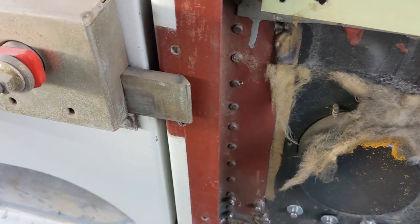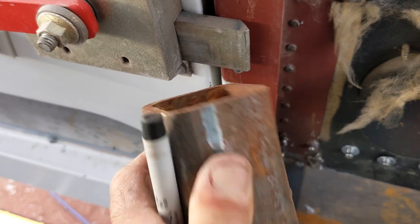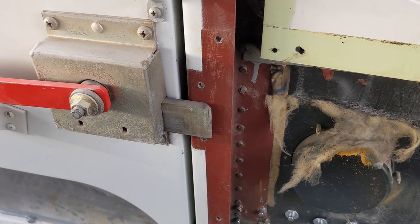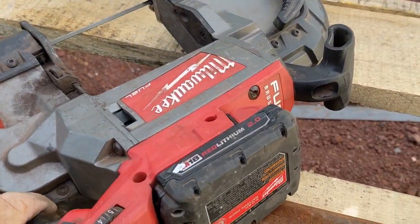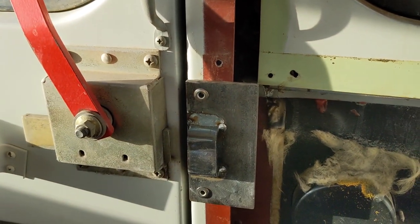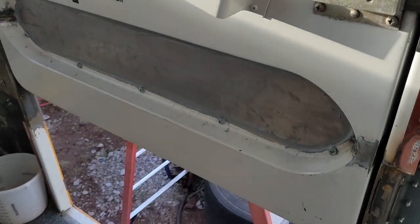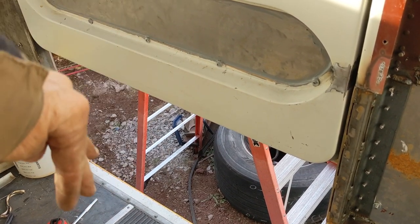For the latch I'm going to put a piece of eighth-inch steel plate just to pull that up tight, then cut a piece of square tube — basically just using it for the bends and its good shape — and weld it to the plate. That'll make a nice solid deadbolt latch strike plate. One of the best tools I ever bought was this Milwaukee portable bandsaw, so I just zipped this off and measured out a piece of plate. I might have to trim this a bit — I want it snug but that should be good. The door latch is done and it holds up tightly. Now I just make the little bottom panel with a piano hinge.